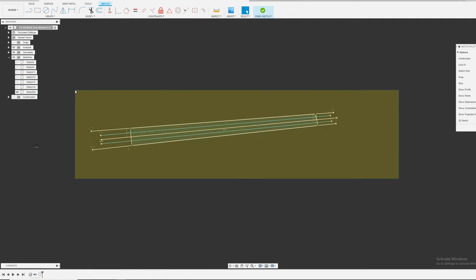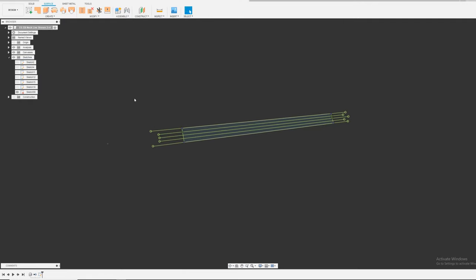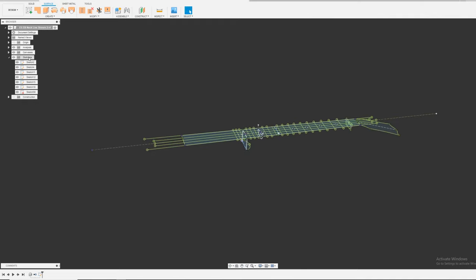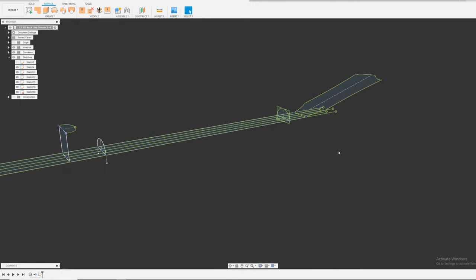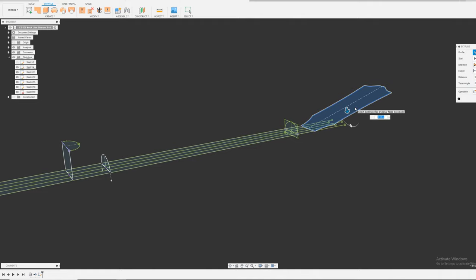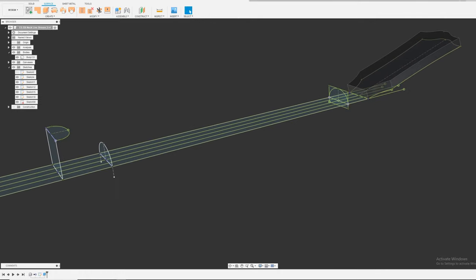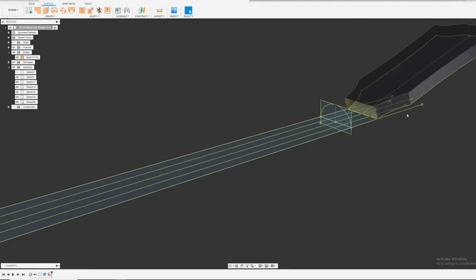Okay. Lock those all in place and finish the sketch. So now we've got some more stuff to work from here. I don't really need this one anymore. So what we're gonna do, we'll start off with the headstock. We'll just extrude that out, negative 0.5, pretty standard dimension for that. We're already in the surface area here, so I'll just select this and delete it. Because I don't really want that face, and I don't really need these faces either.